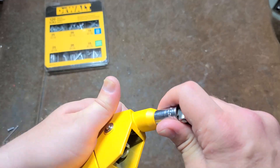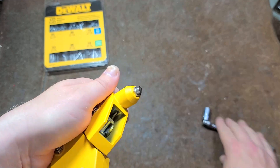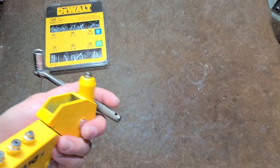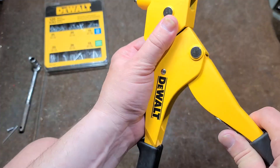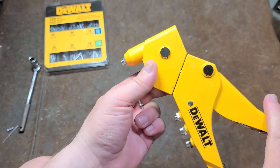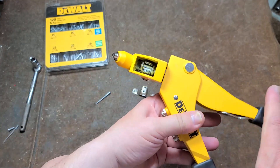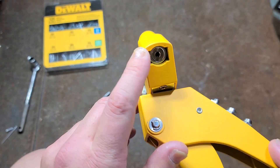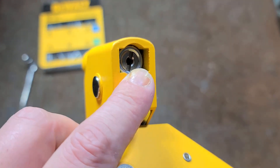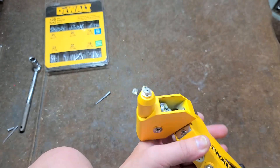It's a little bit funky because if you're torquing it, it tends to want to swivel the head, so you need to hold it properly and get a decent torque on there. The whole deal with swivel head riveters is so you can get into tight spaces. You can also adjust the jaw tension by screwing the end cap in or out, and that can help resolve some issues.